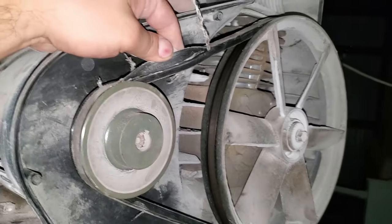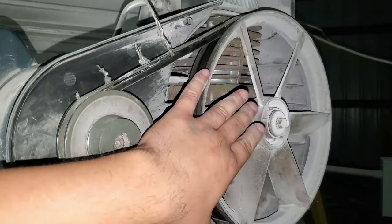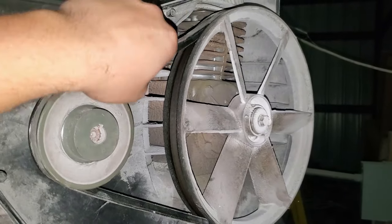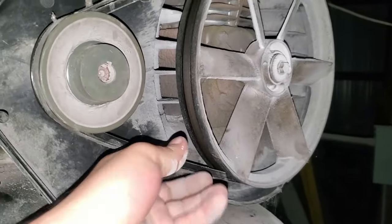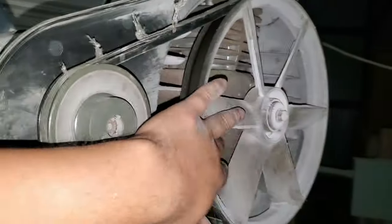The reason we're having so much slippage and it sounds like the motor is not grabbing or having trouble turning the pump is because it does not have a good firm grip on the pump pulley. There's a bunch of play and it's simply not tied on to the other pump pulley.